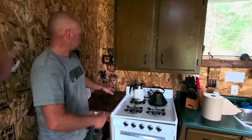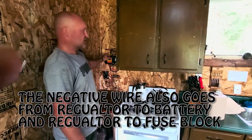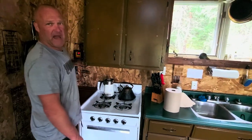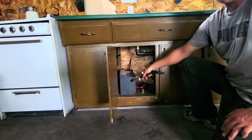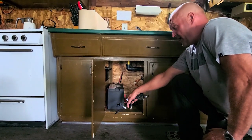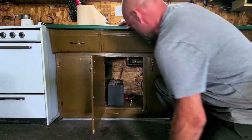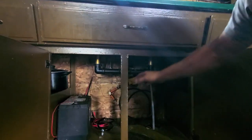The other thing you need is batteries. This regulator has one wire that goes to the battery, and it feeds in both directions — when the solar panels are charging, it regulates power back and forth. So it's only one set of wires and the regulator does all the controls. I ran two wires from the battery input/output down here to my battery. This is a heavy-duty 1,000-cranking-amp truck battery — I got it cheap. I would recommend, if you have the money, buy a lithium battery, or at the very least a big heavy deep-cycle battery, since they're meant more for the up-and-down charging. And down here is my 12-volt RV pump, running on a separate circuit — that runs my water in the cabin.